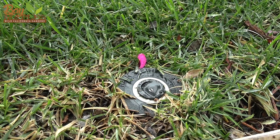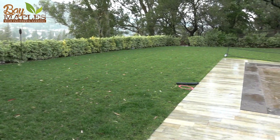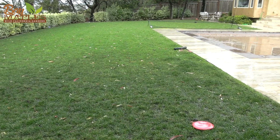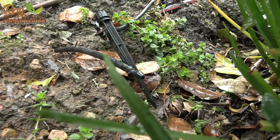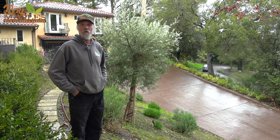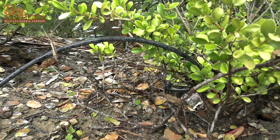Because this water is being cleaned to a level which is NSF 350-C, we are actually going to use overhead sprinklers to water this lawn, and that's all fine because of the degree to which the water has been cleaned. Most gray water systems cannot do overhead spray — it has to be discharged underneath mulch, and you can't store the water for more than 24 hours because it actually gets quite nasty. Additionally, we will be irrigating through emitter tubing out here, and because there are no solids or bacteria in our water, we don't have to use a special kind of gray water emitter tubing — we can use basically anything off the shelf.